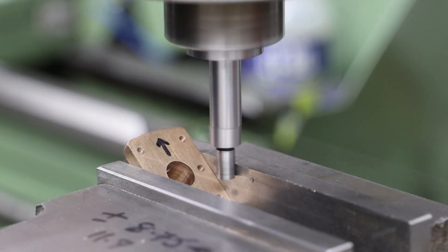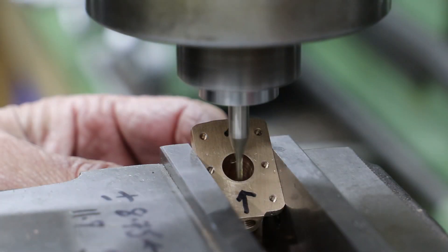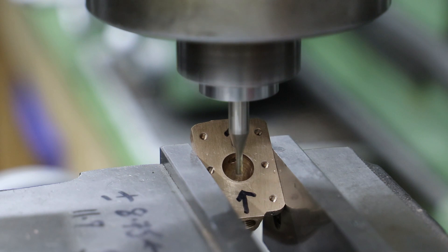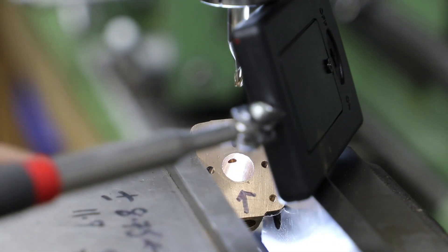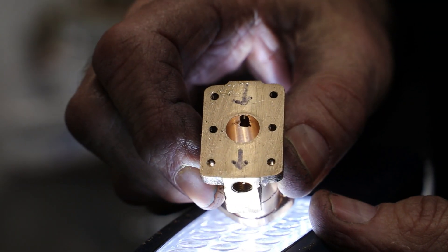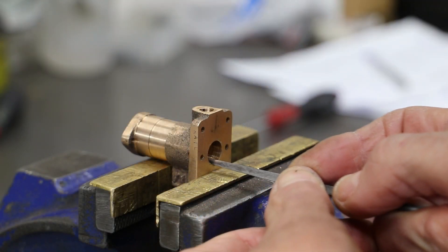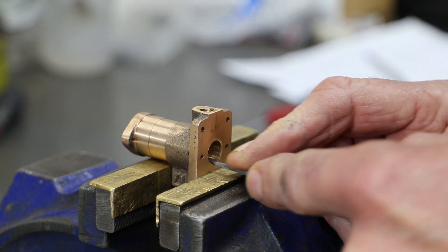To finish off the body, I cut the slot where the inlet port breaks through into the bore. This is to prevent the ball from acting in reverse and stopping water flowing into the bore. I use a small slot drill for this and it's all done by eye, which given how small the slot is and the difficulty getting clear visibility, is easier said than done. I do not side load the slot drill; rather I cut straight down but in two different positions, and then use some needle files to bring the slot into shape. For the slot into the outlet port, to prevent hydraulic lock, I carefully file this to shape.